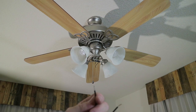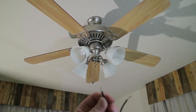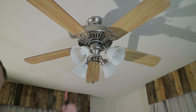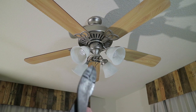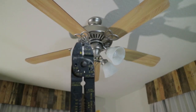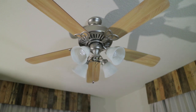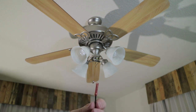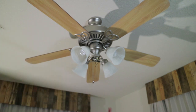To connect this new switch using the inline butt splicer, you need to take the end of your wire and twist it as tight as you can, and then slip it into one end of that butt splice, just like so. And then we're going to crimp it. This is a crimp connector. You may have a set of crimpers that look like this - a set of pliers. These are usually the cheaper ones. You see it's got three different colored dots: yellow, blue, and red. This is a red connector - it has to do with the size of the wire and the size of the connector. So we're going to use the red, put that right on there, and just squeeze it tight. It's in there.